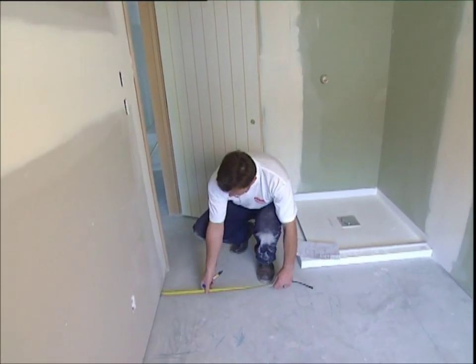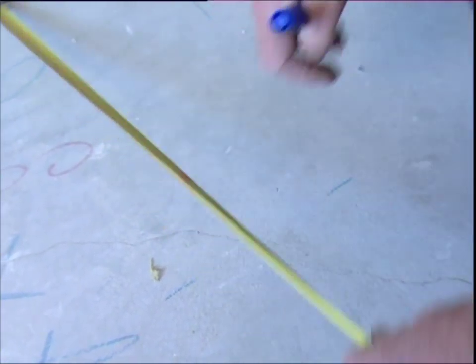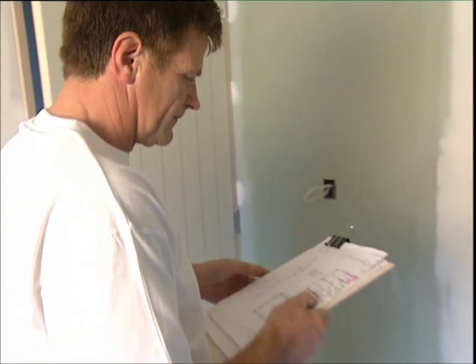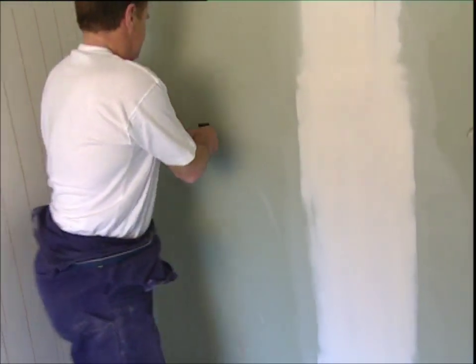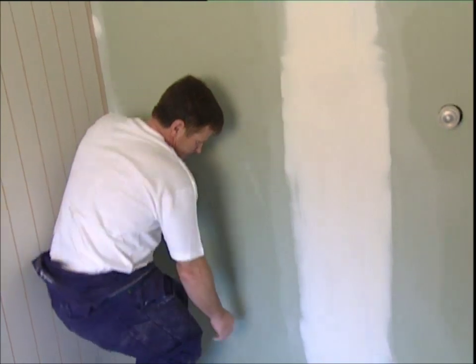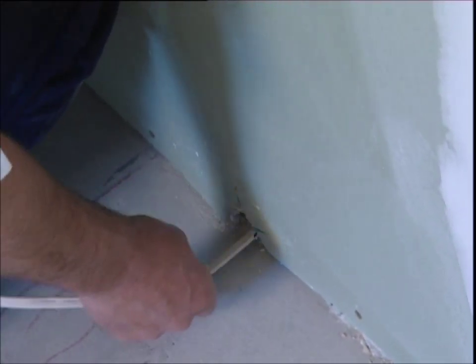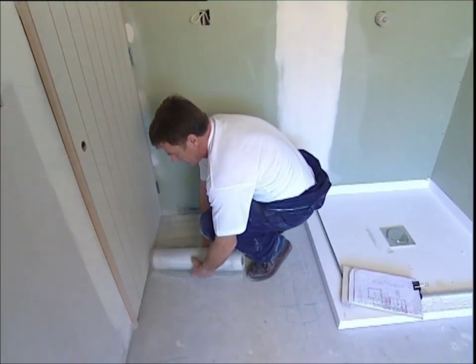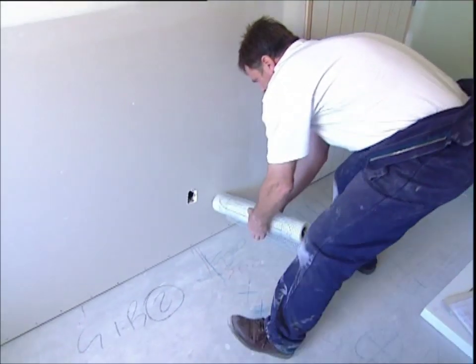A little forethought and planning at this stage will help everything go smoothly. Know where you're going to start laying the element out from, remembering that this is also the same point you'll finish at. Check the house plans and identify where the draw wire is, ensuring it's free to draw through the wall for your cold tails. Mark out the connection point, noting that both your start and end cold tails will meet there. As a final precaution, recheck that you have the correct product by noting the cable label and testing certificate again.